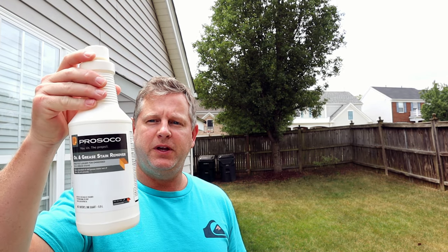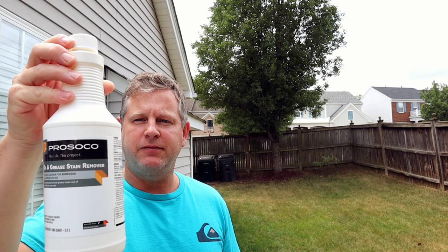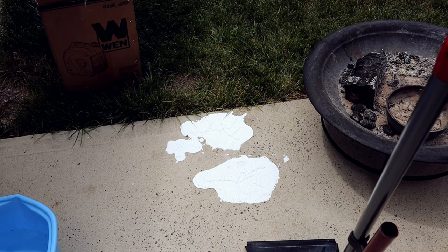We had applied our Prosoco grease and stain remover on unsealed concrete. Depending on the temperature, humidity, and environment, you may or may not be able to get to it the next day. I had two spots I was able to let soak and dry for 24 hours, but then it started to rain on the other two so we had to cover them with boxes. The humidity changed, it got cooler, so it took longer for the Prosoco to dry. Some of these spots have been down for almost four days — we've been keeping them dry with cardboard boxes through some wild weather swings over the Memorial Day weekend. It's been about four days since we applied it; we'll see what the results are.